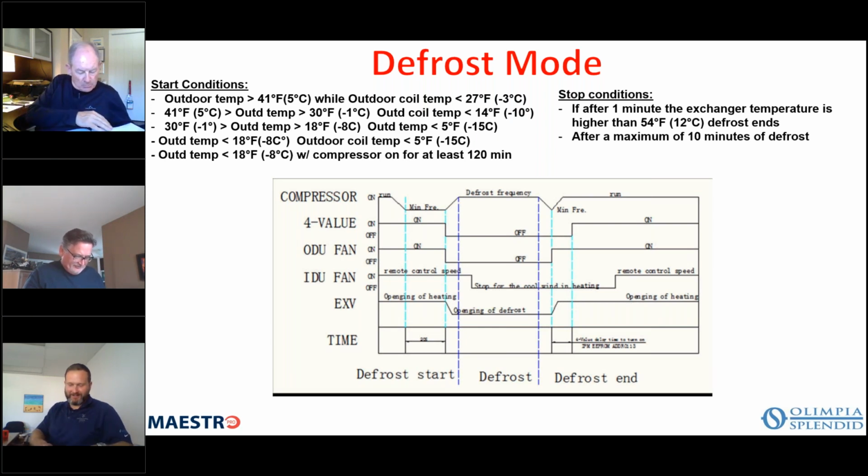So if you have, for instance, an outdoor air temperature sensor failure, you'll have one yellow blink and the display will show the numeric 1. If you're in defrost mode, for instance, which is not an alarm, it lets you know what mode it's in, the red LED will blink on once, and the yellow LED will blink once, but there'll be no display. That tells you you're in defrost mode.